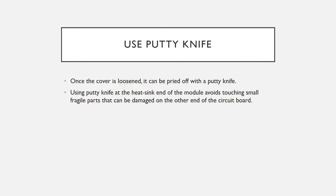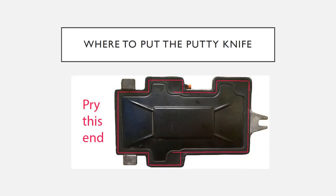Once the back plate is burst loose, use a putty knife to pry it apart. It'll come apart but it has to be worked gently — the back plate is fairly stiff, so be careful not to bend or distort it. Pry on the end where the heat sink is inside the unit because there's nothing there to hurt. On the other end there are small components that you could bend or damage, so pry on the heat sink end.